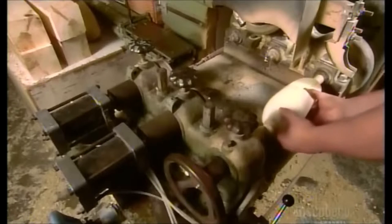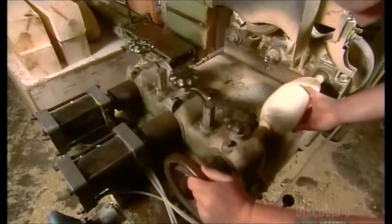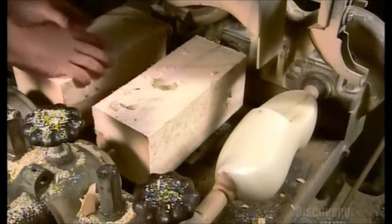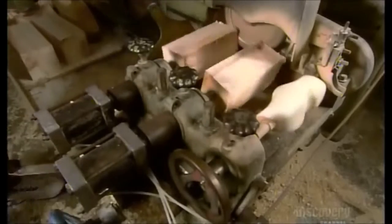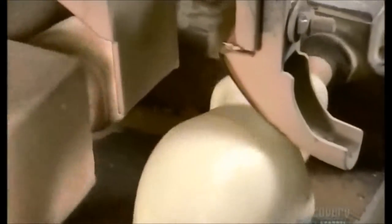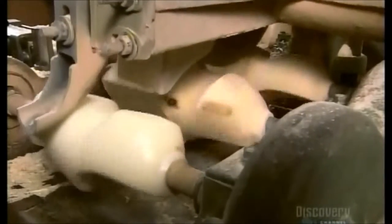The factory uses vinyl patterns like this one to create the shape of the shoe. There's a pattern for each size of every clog style. A worker locks one into a duplication machine called the shaper, then right next to it, two blanks. This tracer moves over the shape of the pattern, and the wheel on the left copies the tracer's movements exactly, its blades shaving the wood as it moves up and down. There's only one pattern loaded, yet the machine carves out a pair of shoes. That's because the blocks of wood spin in opposite directions while the blades chip away at them, essentially creating mirror image copies — allowing the machine to carve out both a right and left shoe simultaneously.